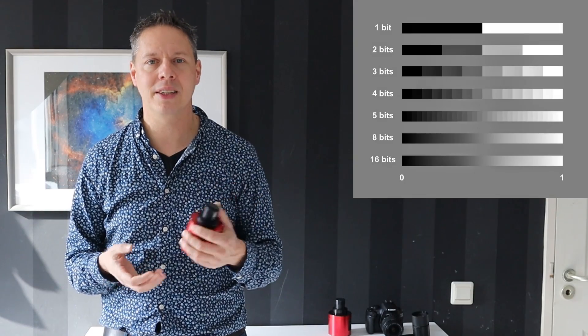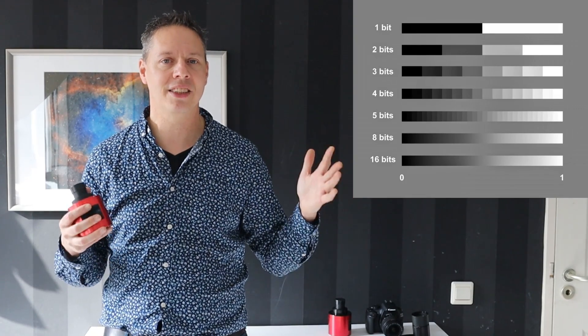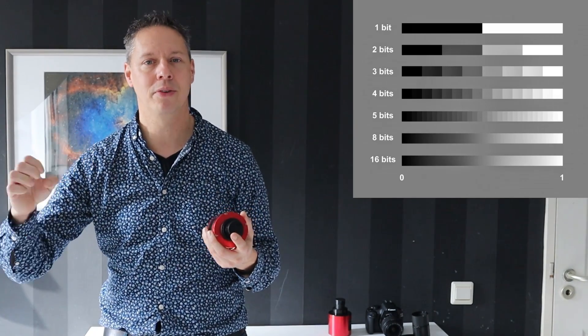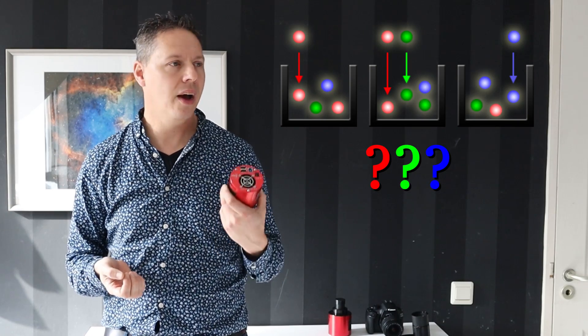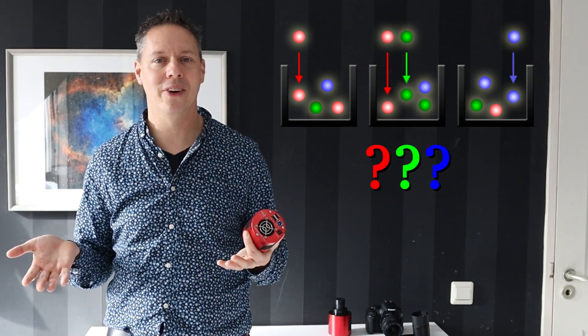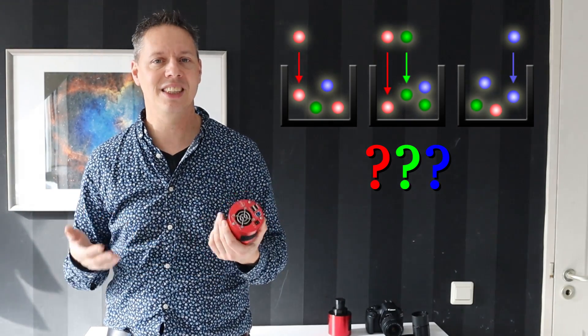What is important to say is that the higher the bits of your ADC — so you may have a 10-bit, 12-bit, 14-bit, or 16-bit ADC in your camera sensor — the more variations your camera is able to detect between the completely black point and the completely white point of your image. But most importantly, a mono camera cannot distinguish between the different colors of light that fall on the camera sensor. So we need a filter, or several filters, that can distinguish between the different colors of light we want to capture.